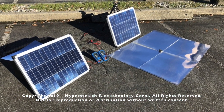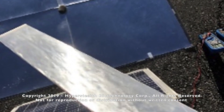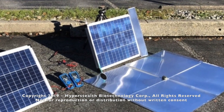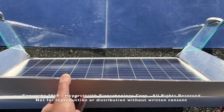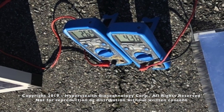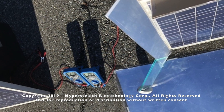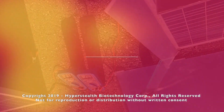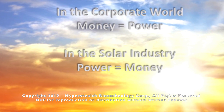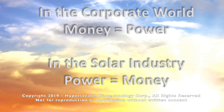Most of these examples are not practical for pre-existing solar panels connected together on a roof. There is a boundary around most panels in which we can place slat boosters — small versions of the lenticular lens over mirror. When tested with and without them, just three slat boosters accounted for 16 percent more power, which is an extra 12.84 watts over the amplified panel with no slats. The boost from just these three slats allowed the panel to equal the maximum output under perfect conditions. In a place like Vancouver, where solar radiation is half or less than half of the maximum most of the year, this could change everything for the solar industry.